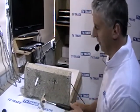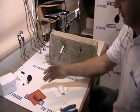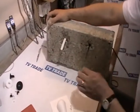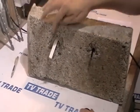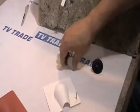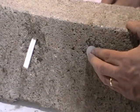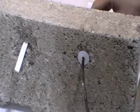This product will almost exclusively be used on the external of your house and comes in white and red, which is sufficient to cover almost all external walls. On the inside, an alternative product we'd use is the Grommet. This is a 10 millimeter hole for a single cable or a 16 millimeter hole for a double cable. The Grommets come in black and white — you push the cable through, tap it in with a hammer, and it just pushes straight through, giving a very neat finish on the internals of your house.